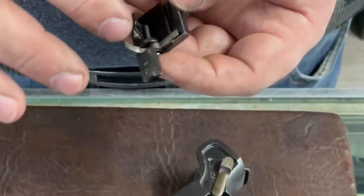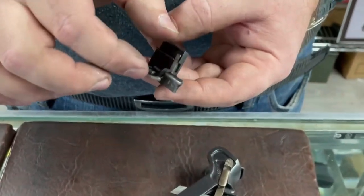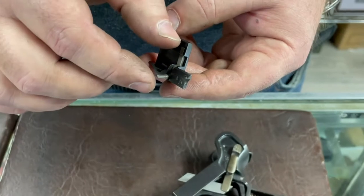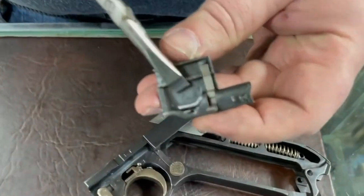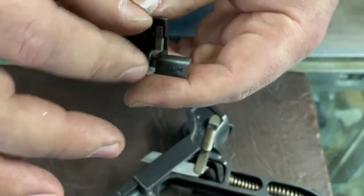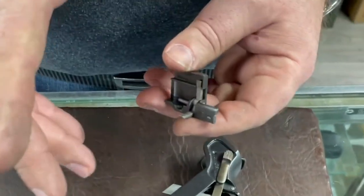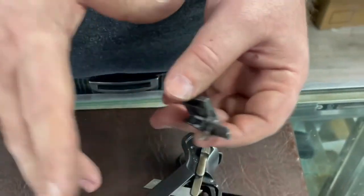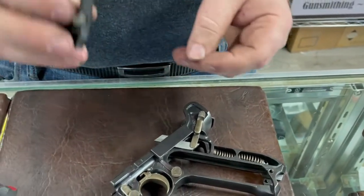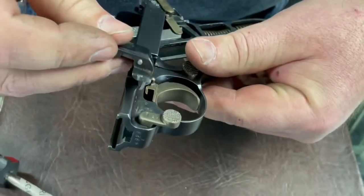Watch how the trigger lever on the side plate moves when you pull the trigger — it should move nicely and evenly right away. If nothing happens for a while before it starts moving, you won't have a good trigger pull. We manufacture levers slightly oversized on both ends and fit them to the gun to enable trigger pull adjustment. The levers come hardened; to adjust them you must anneal, reshape, test on the gun, then re-harden.